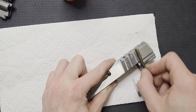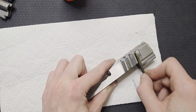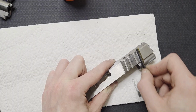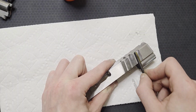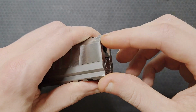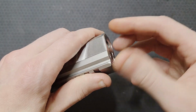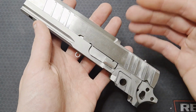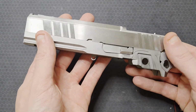I didn't see any improvement in machining marks taking a shallower or deeper cut. They sanded out with 400, then 600 grit and some oil pretty quickly. The whole cleanup process took a couple hours because I had 20 grooves to do. I cleaned the muzzle bevels up with fine stones. That went pretty quick. This whole slide will be media blasted prior to nitride treatment.